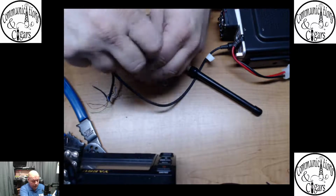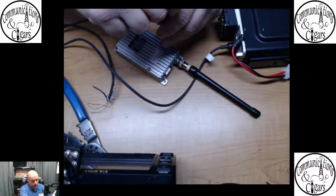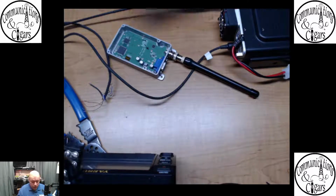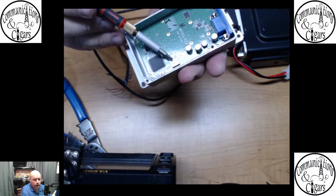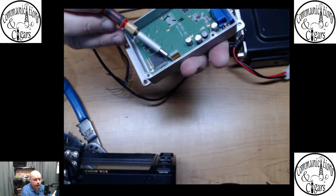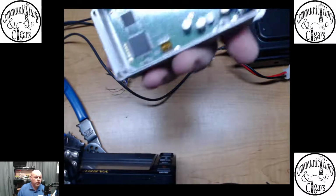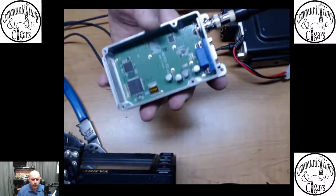What's going to happen is they're dip switch programmable, and I've thought about using my own little soldering skills. So pop the cover off and move that out of the side. As you see here, 32 channels, set by these little dip switches right here. It is a hex switch, trying to get it out of the light there. They actually have a little plastic coating over it. A little later, in order to change channels, I'm going to flip one of those. I love this radio, hands down, and here's why, folks. A couple of reasons why.